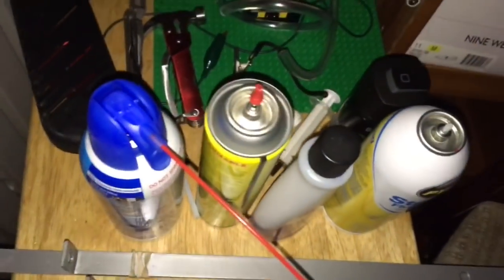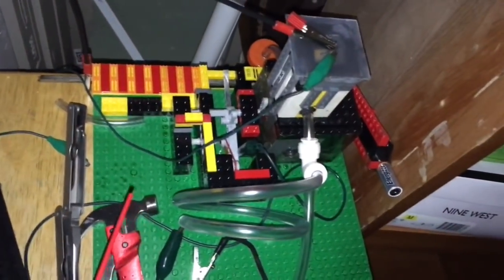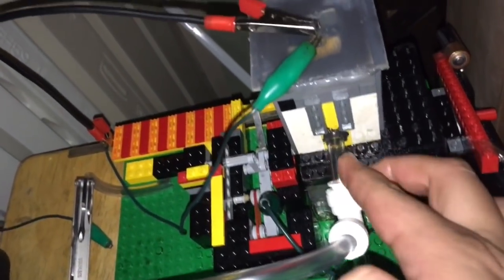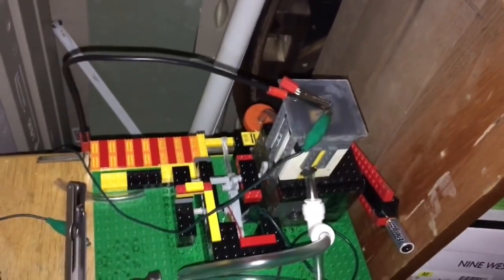This is the flywheel. We wanted to use weights that are equally heavy, so we just used two AA batteries because they were easy to find. We hoped that would give us the momentum to keep the motor going, but unfortunately it didn't. These are the bottles we used as the fuel and none of it worked. So we gave up with the check valve idea and started to inject air duster air straight into the transfer port. At the same time, we also tried injecting butane — it comes down here. You would put in the air this way and add in the butane from the top, so by the time they reached that point they would be evenly mixed and enter the combustion chamber. Even with that, it still did not want to fire.